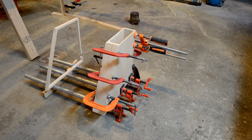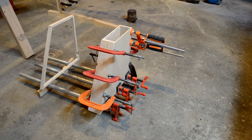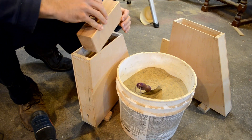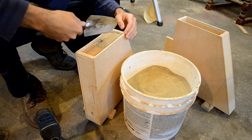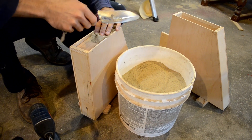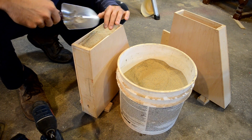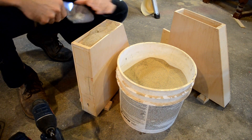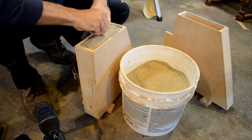With our new nail strategy, the thicker box was no longer necessary, so we went ahead and ripped out just one inch from the very center and biscuited it back together. We actually ran out of nails before we ran out of room — each box has 25 pounds of nails in it. I put a piece of wood in the end and then filled the balance with sand, so the nails wouldn't float around, and if I needed to add more later I could. I have a little room to make these heavier, and we loaded them from the inside out the way they hang, so weight distribution isn't yet optimal — this gives us a few ways to increase counterweight effectiveness without making it physically larger.